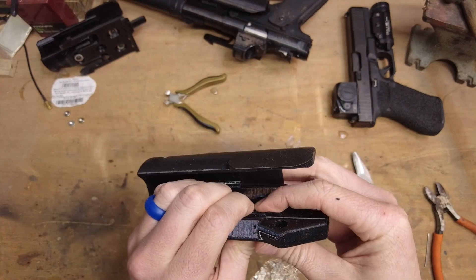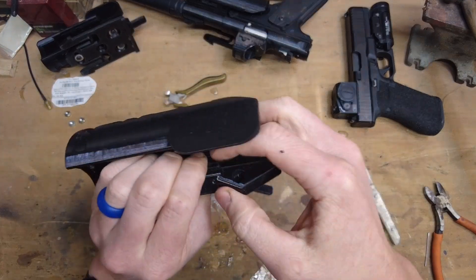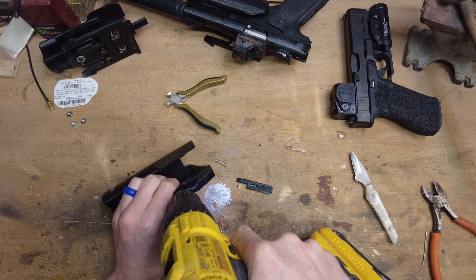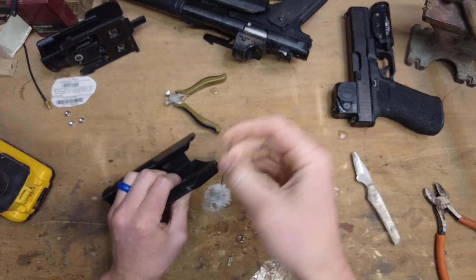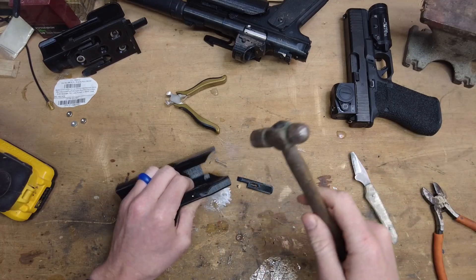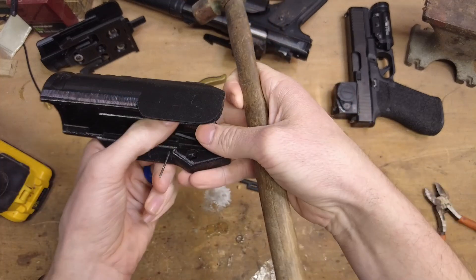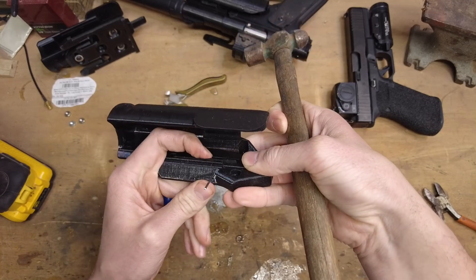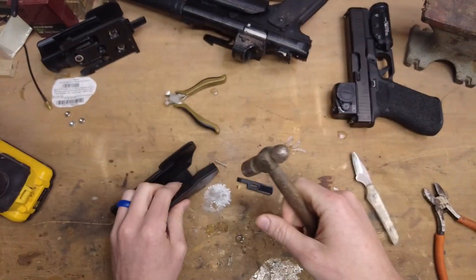Pull the locking tab all the way down to the bottom inside the notch and push it down flat. Once we've done that, we can send our drill through once again just to make sure the holes are going to line up, which they feel like they are. Then take a piece of 16th inch pin stock and tap it in — I got it from a knife maker supply place, but I'll drop an Amazon link below. It feels like we've got just a little bit of a hangup on top, but that should wear in. If it doesn't, we can always pull it out and sand down the top of that locking tab just a little bit.